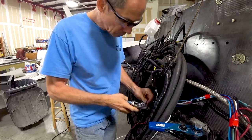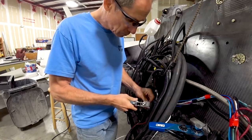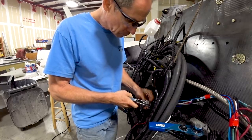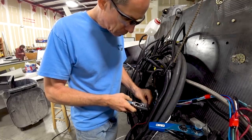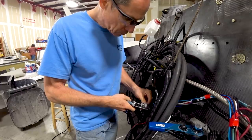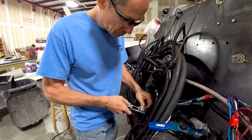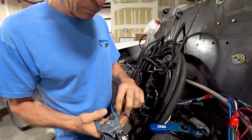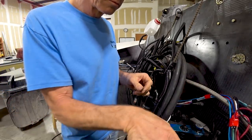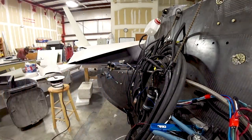A bunch of running wiring through to the ECU, then a line back out from the ECU to the compressor, putting a new connector on the compressor line, running it neatly inside the harness, and putting the black plastic wire loom back on everything and tidying it all up. It ended up taking pretty much the whole day for this one job, but in the end I got it all done.